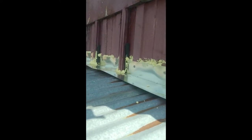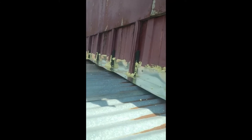Here we are the next day with a better view of that foam — the Great Stuff has dried. I took my garden hoe to reach out and scrape off a lot of the overspray. The downside of this stuff is it's not pretty — I could sand it down and paint it eventually. What it should do is allow water that hits my workshop to hit the flashing and run off the roof, instead of running straight down the side onto my bricks and filling up the chicken coop with water. It's supposed to rain pretty good tomorrow, so I'll get a real good sense of how well this keeps the rain out.